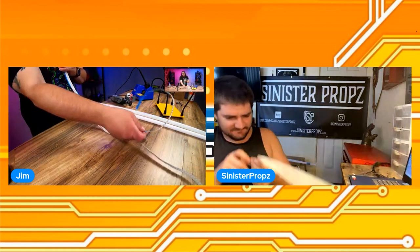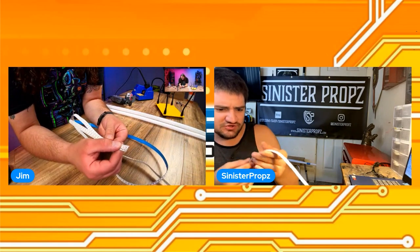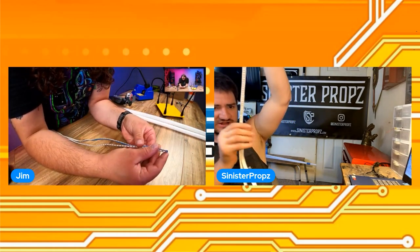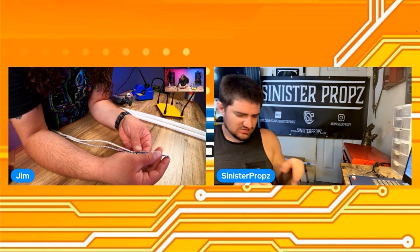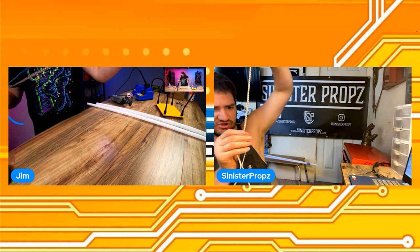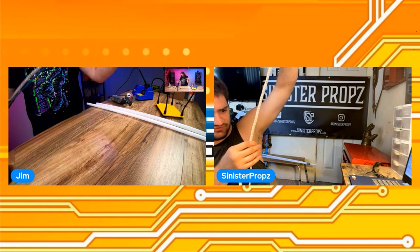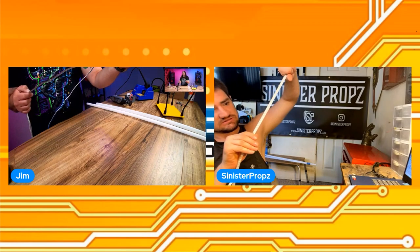Oh boy, trying to figure out the best way to do this here and show it. So when you get to the joint, where it's essentially two strips soldered together, be careful, because sometimes they're not soldered together straight and you might have to correct a little bit. You'll find it when you keep going down, you're gonna run into a solder joint where they soldered two strips together. Just make sure that they're realigned, because for instance, mine went off center because my two strips weren't perfectly aligned.